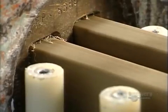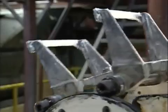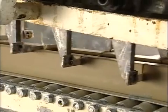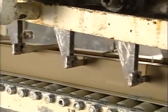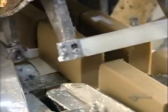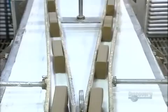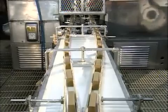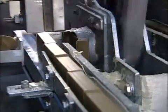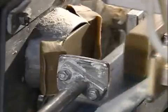Next, they push the soap through a forming plate, making a long bar. Blades mounted on a track slice it into shorter pieces called slugs. The soap slugs are on their way to the next stage. They're on a 2-lane thoroughfare, heading into a die press. A mechanical arm pushes the slugs through an oval plate, trimming it and then loading it into the die.